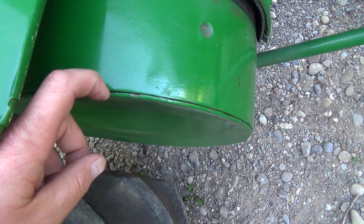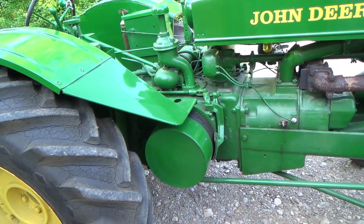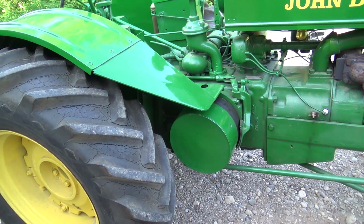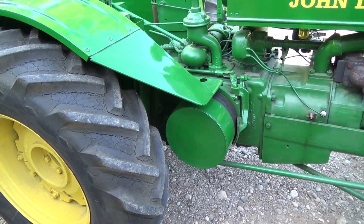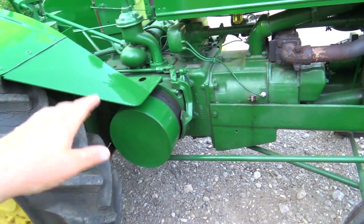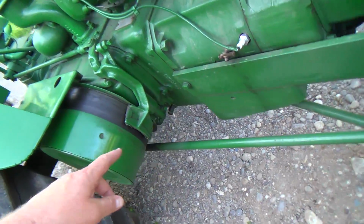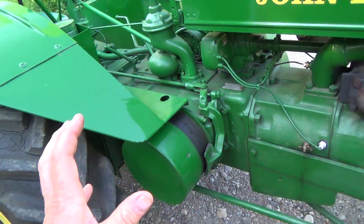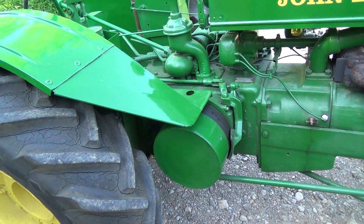So anyways, we got to try to hopefully get this old cover off. She can't believe it's still on there. Usually they're the first thing's gone, but got to get that off, and we're gonna have a look see in there. I do have some stuff to clean it out once we get in there and have a look, see if it's oily or what. It's got to be oily, because when I changed oil, let it run for like an hour to warm up, which it didn't really warm up. I could see streams coming down each side, like not streams, but you could see like a trail of oil, so it's coming out of the crankshaft seals.